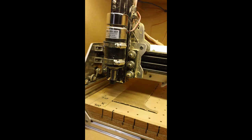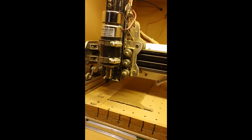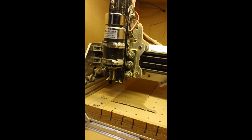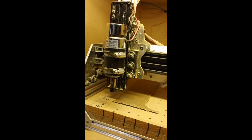Speed zero — turn it off. M05 to turn the spindle off, PWM completely down. So we loaded a program here. Speed zero just for this test run. Going to hit run to execute that program.